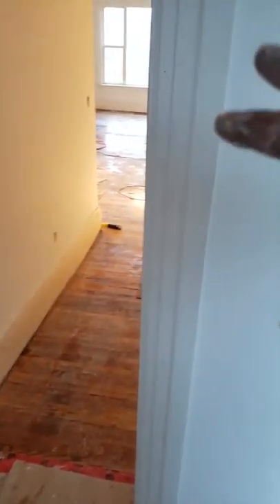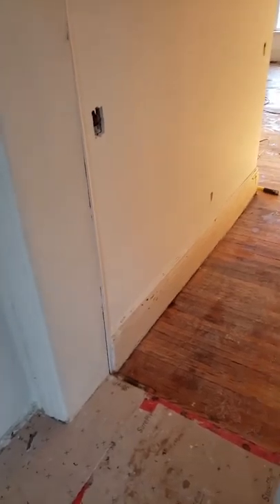I've run out of primer now. I still got to cut in the angles, but I'd like to wait till I get all the walls primed and rolled out, and then go through the whole house and cut all the angles in one shot. I didn't roll any of the trim that had roughness on it — I want to scrape them and brush them with some heavy grit sandpaper first, then patch them, sand them, and then prime them so we're not wasting any primer.